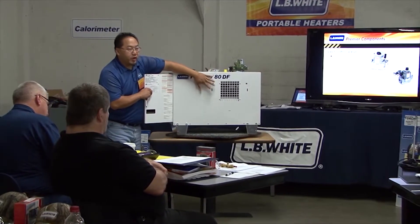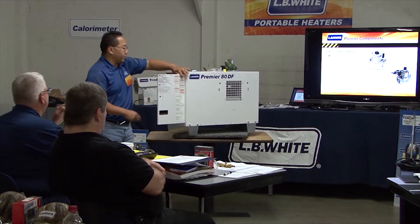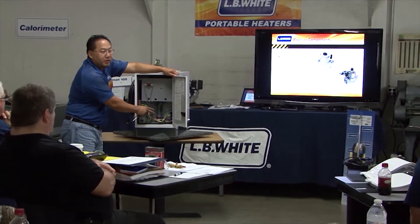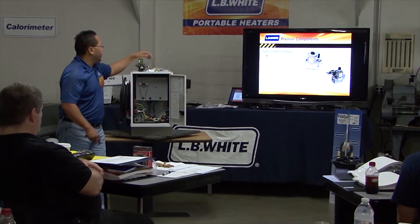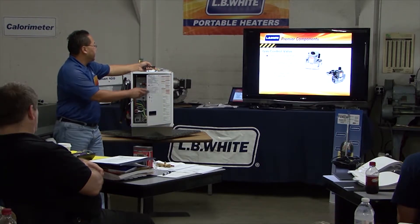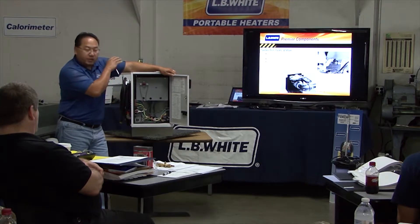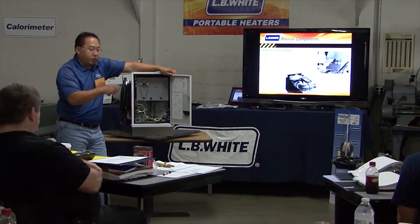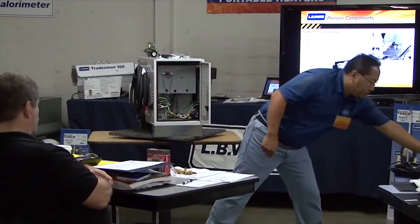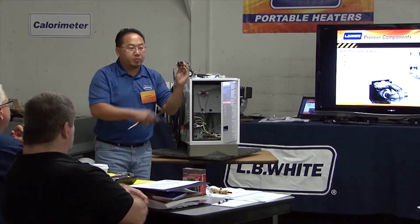The outlet is usually the front — so those are the front and these are the sides. Some people think the control valve side is the front, and technically that is true, but we can orient it to the side. The control valve is located right here, and both valves operate on 24 volts. The dual fuel system has a gas valve selector — just a quick lever going from LP to natural gas. It's a standard valve that we bore a hole through to mask the LP gas settings.